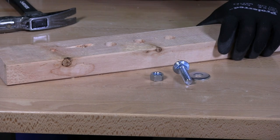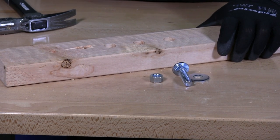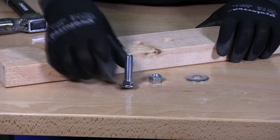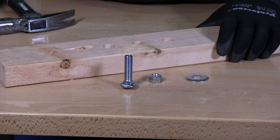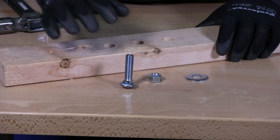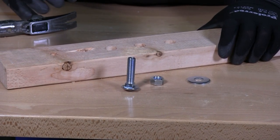Welcome back to Albany County Fasteners, Fasteners 101. I'm Bob, and today I have a quick tip on a common question from a lot of buyers. They constantly ask: what size hole do I drill for the carriage bolt I'm installing? Whatever the size of the carriage bolt is — in this case it's a half-thirteen — you drill the same diameter using the same size bit.